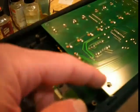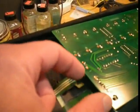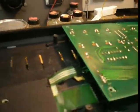And so all those are double coated, at least, I guess, three coats total on one side, twice on the other. And you can see under there I've got ribbon cables that then fold back, and they go back into the original holes there. So I just removed those connectors, and now they are RV Gooped down. As you can see, it's tacked there so that these will not move.